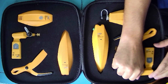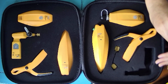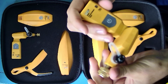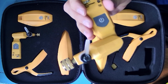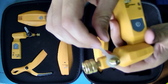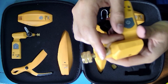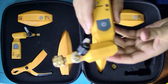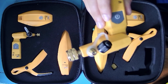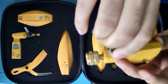The pressure probes or pressure transducers are very unique in that they all swivel. Our pressure transducer swivels 180 degrees, and it also has a port that allows you to connect for charging or recovery of refrigerant as well. So not only do you have full flexibility of the space you're working in because it swivels 180 degrees, you can also use this port for charging and recovery of refrigerant, which is very unique to the UEI brand specifically.